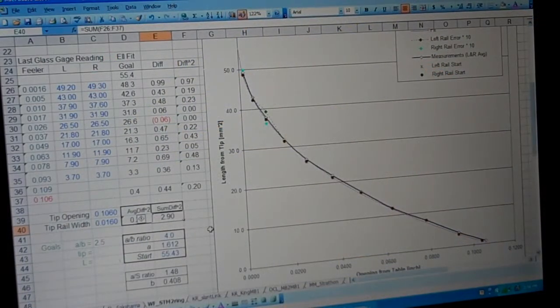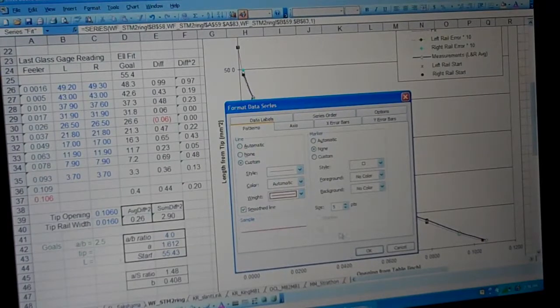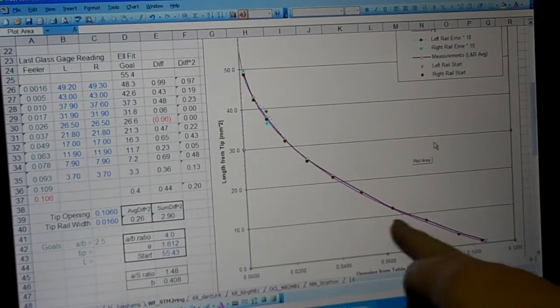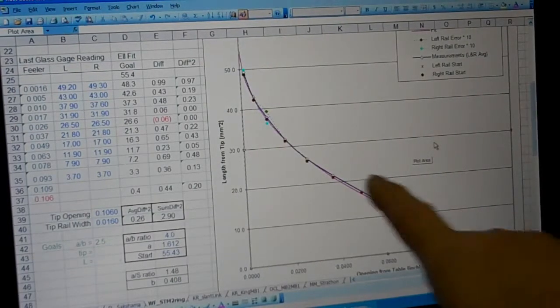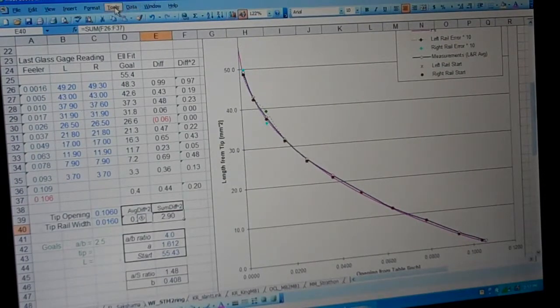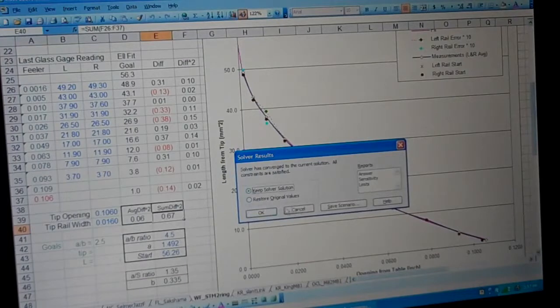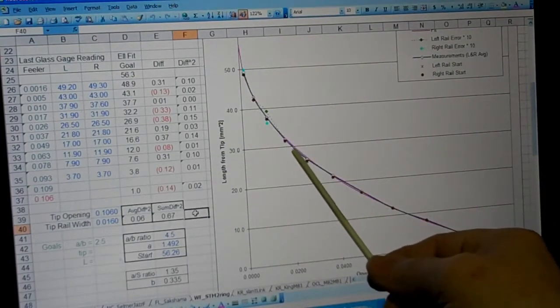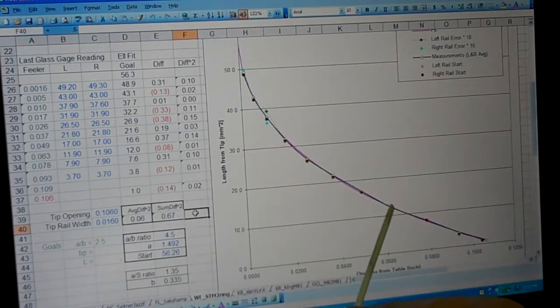Okay, this is where we are. Let me make this old target curve a little thicker so you can see it. The dark blue is where we're at. The magenta was the original curve of best fit through it. I've straightened out most of the flat spot here. There still looks like a little bump there. What I'm going to do now is recalculate the target curve, regenerate a new best fit through these points. I still have a bump back here that I have to work on even though I've been cutting it some. This is a little low, this is a little low, and there's a bump there so I can bring that in.